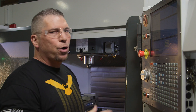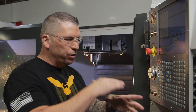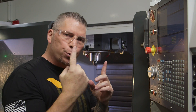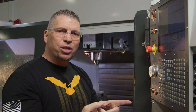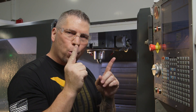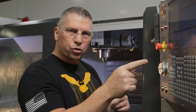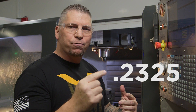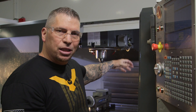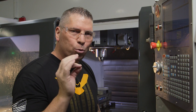I already wrote a program to face the top of the material in my chuck vise. We face the top, drop down with a chamfer to chamfer the hole for the thread, then drop down with a 0.257 drill — which is the ID for a 5/16-18 thread. The material is faced, drilled, chamfered, and ready to get thread milled.